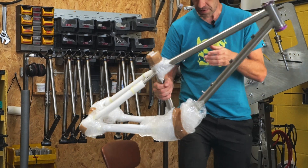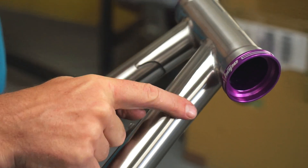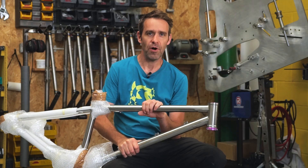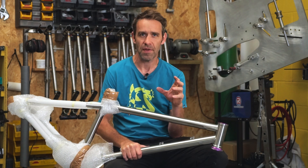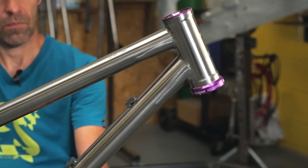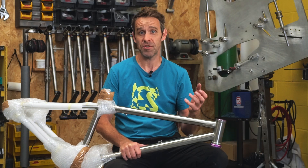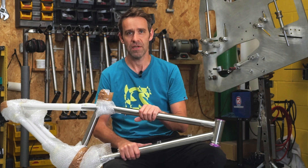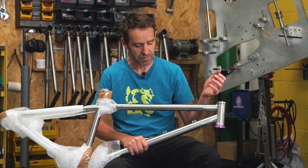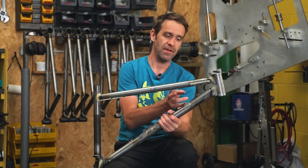This is one of our stainless steel frames made in Taiwan — these actually have the doubler type gusset. The reason is that Taiwanese manufacturers are actually quite conservative. The company we use has never done frames with the plate type gusset, so they refuse to do it — not because it's not a good design solution, but because they haven't got the experience and don't like doing things they've never done before. Our stainless frames don't have it, but both solutions are good — we've had no issues with head tubes on any of our frames, though personally I think the plate type gusset is the best solution.